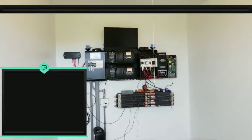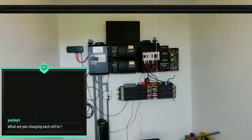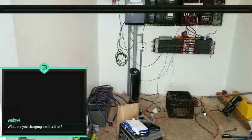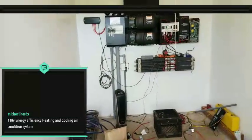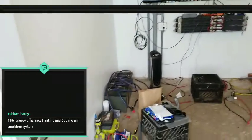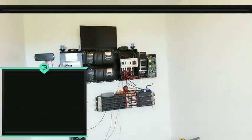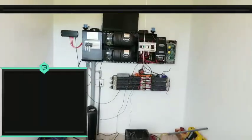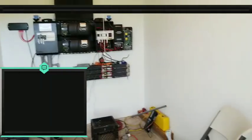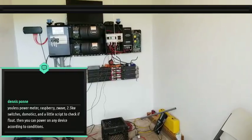Amp hours is a little bit different because of lead acid batteries, right? Once you get to almost 50%, it's time to shut off your batteries already, so you don't technically get the total amp hours out of that. Even if a battery is, say, 100 amp hours, you risk kicking it off or damaging the battery, so you don't even get 100 amp hours out of it, like with the lead acid batteries. Unless you had a bunch of them, then you could make it work, but you have to compensate for the part of the battery you're not supposed to touch. So, like I said, my total bank is only going to be charged up to, on a few days, I might bump it up to 60 volts, but other than that, it's going to be 58.8 volts total.